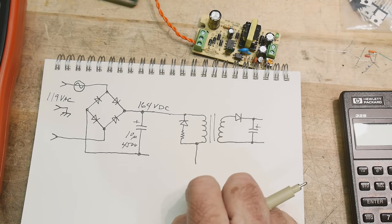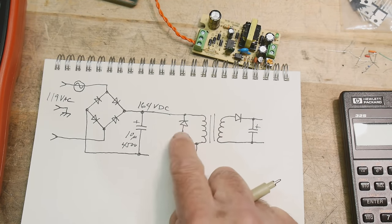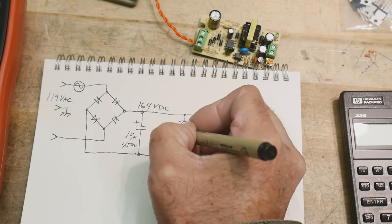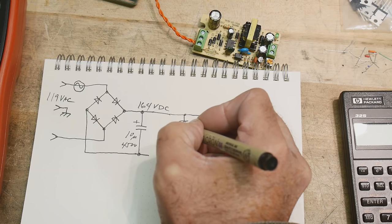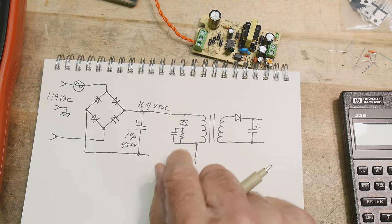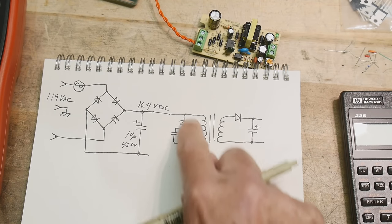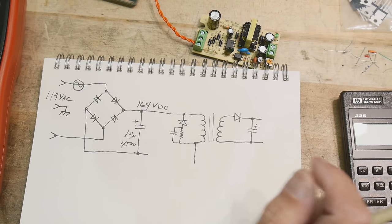And then they got even a little fancier than that, and they said, well, we want to limit the current, but we don't want to slow it down, so we're going to put a capacitor here that will be really good at taking off the edges. It will allow large currents to flow, but only on really, really high frequencies, only on that sharp edge. As soon as we get rid of that high frequency sharp edge, we'll let this resistor do its job. And this will be our snubber circuit, right? So that's what they have in there. So that's what that is.